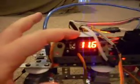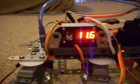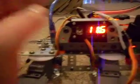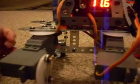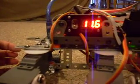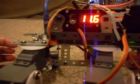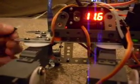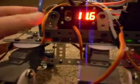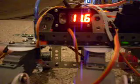Alright, and then the next big piece is right here. This is a Hobbywing voltage regulator. It's a switching power supply. So it takes the voltage of the battery, which right now is 11.6 volts, and steps it down to 5 volts. It's a switching power supply as opposed to a linear regulator, which is on board the Arduino. The advantage is that it's very efficient. It's better than 95% efficient, whereas the linear regulator, if you're very different in voltage, can be very inefficient and also produce a lot of heat.